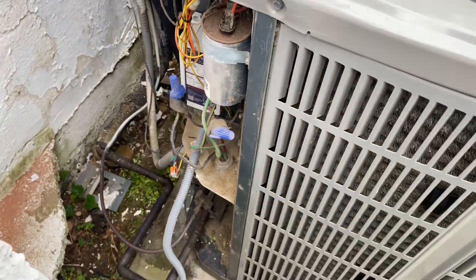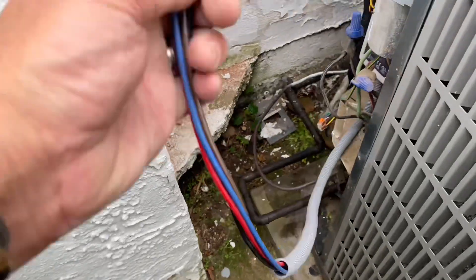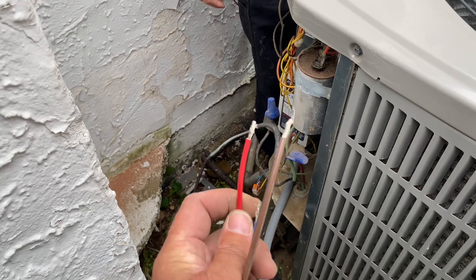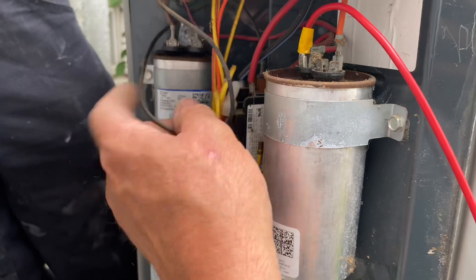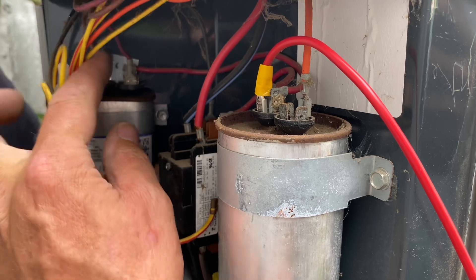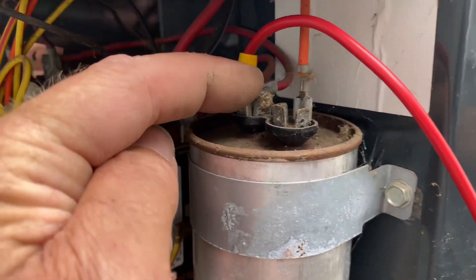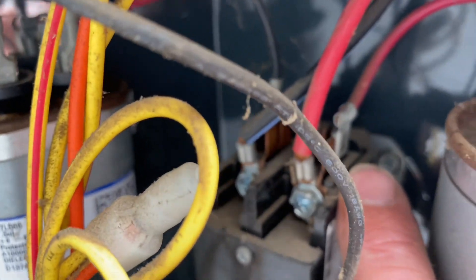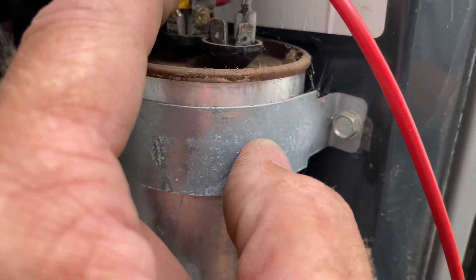Step number two: let's connect our red wire coming from our ICM 870 and connect it to the run capacitor terminal C. In this particular setup I don't have a dual capacitor, but I do have a capacitor from my condenser fan motor and my compressor. The common wire — which is this red wire — they're going to the same block. I have my red going to this terminal, and then this red wire leaving going to that terminal on the top side of my contactor. So I got my red going to common — we verified that was common.